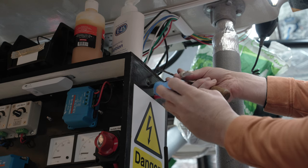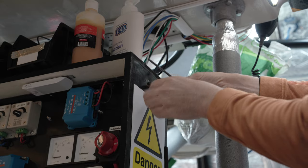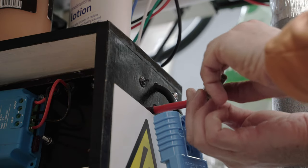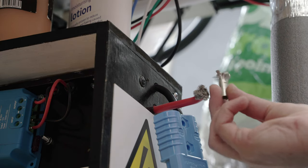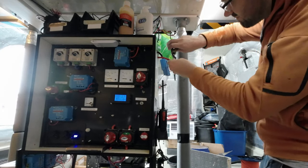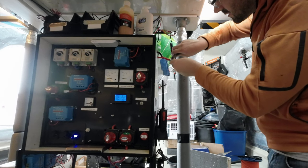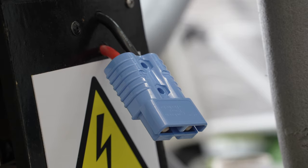I don't need more than 125 amps at the absolute most, but the Andersons one level down were a little small. For those unfamiliar with these heavy-duty, yet not waterproof, non-gendered connectors: you buy the housings and pins separately. Hyperflexible silicon wires aren't quite stiff enough to click into place, especially thinner gauge ones, so I tend to use a flathead screwdriver to guide the pins into their seats.